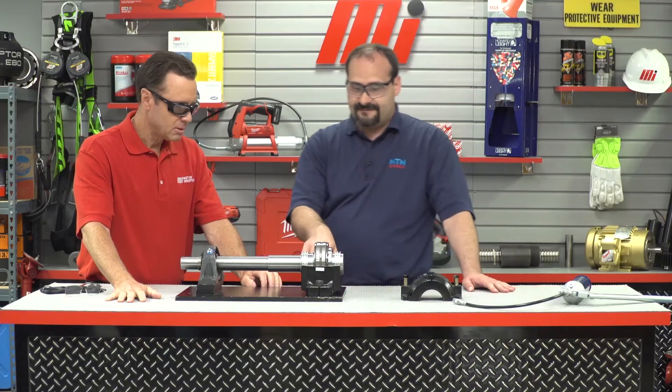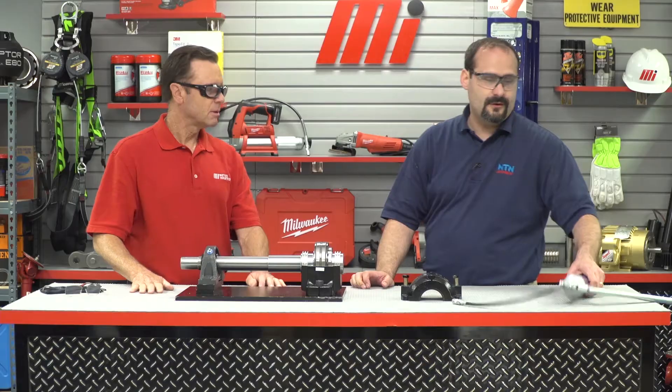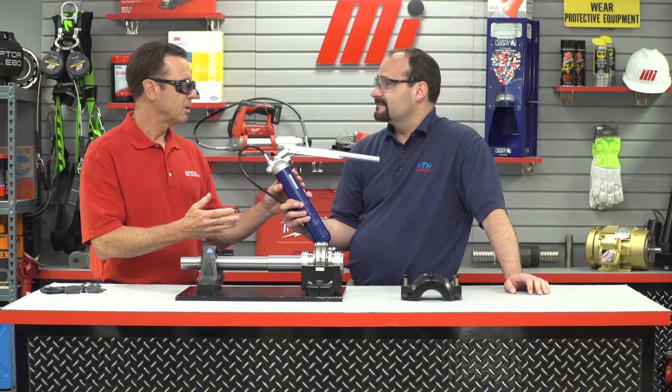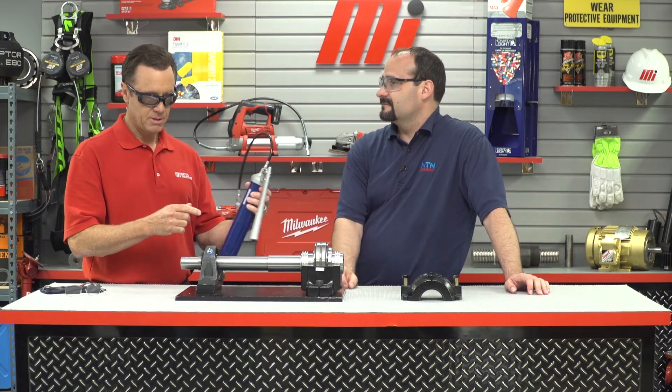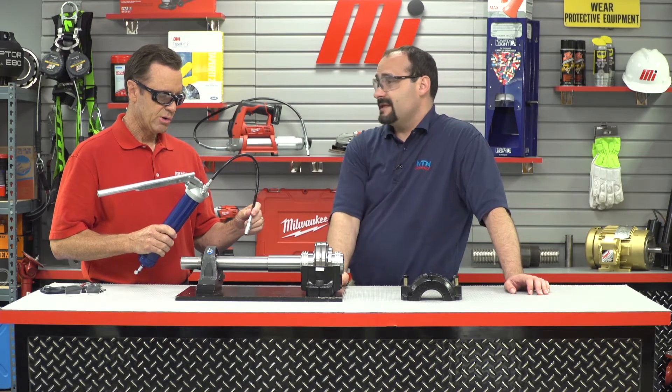For our SAF 515 housing here, that's between seven and eight ounces. With the grease gun we'll use here at 28 pumps per ounce, that's about 200 pumps total — 100 aside, 50 per corner.